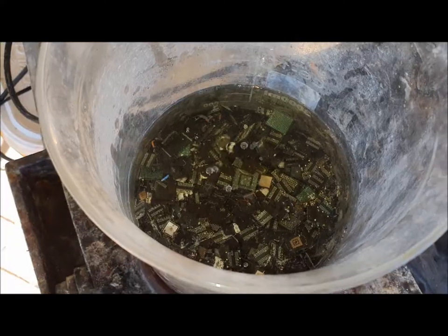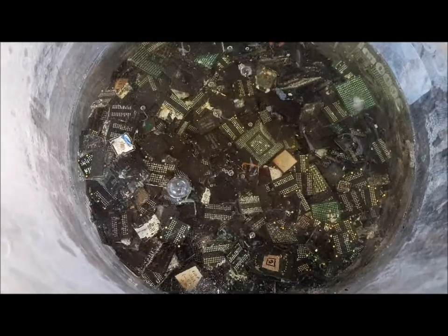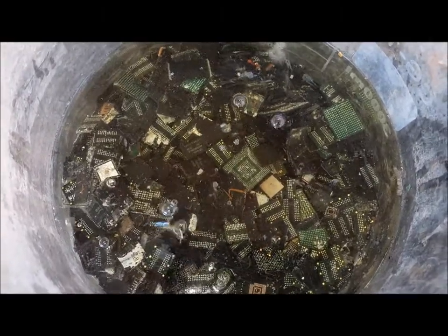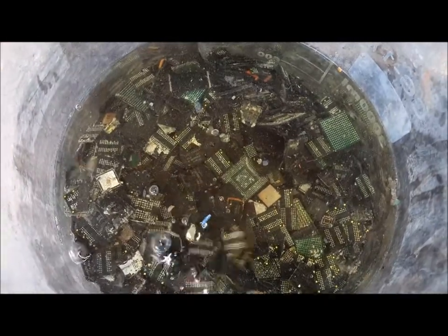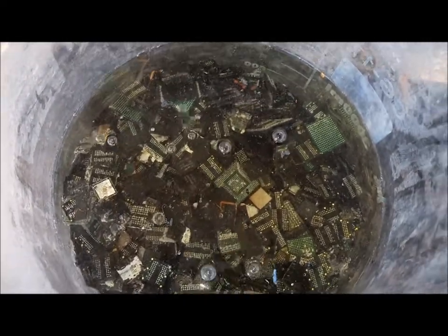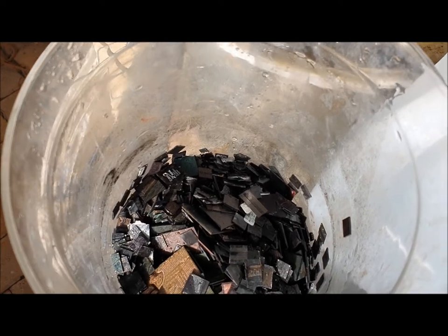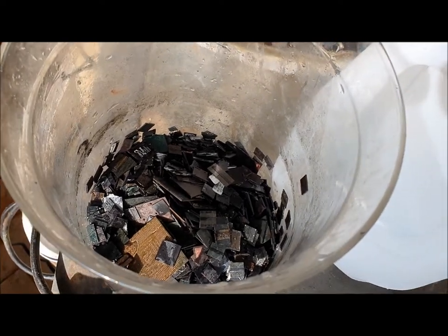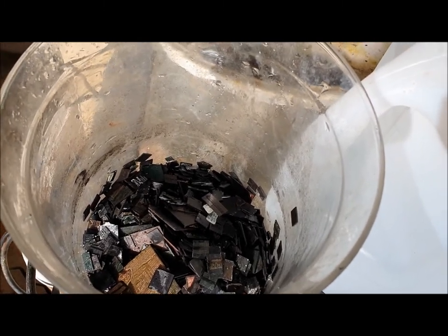So I've got the BGAs in a beaker with hydrochloric acid — just poured it in there and put it on the hot plate. It hasn't even got hot yet and you can see there's already a reaction. Every so often I'll give it a stir to make sure they all get acid coating and aren't pressing up against others that can't get it. I'll give it probably half an hour on heat, doesn't have to be very hot. They were soaking in hydrochloric acid on heat for about half an hour or so. There was no more reaction, no more bubbles coming up, so I've drained it off. I've kept the hydrochloric acid — I'll use it again some other time — kept it labelled 'used hydrochloric acid'.